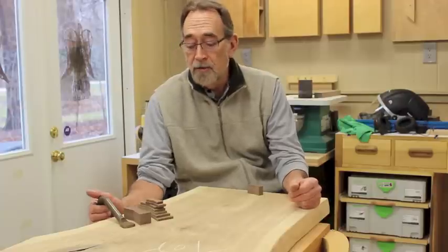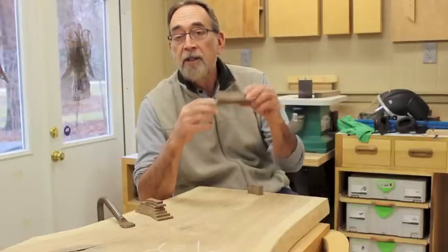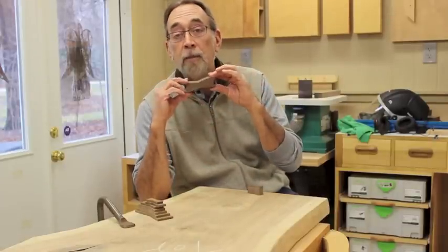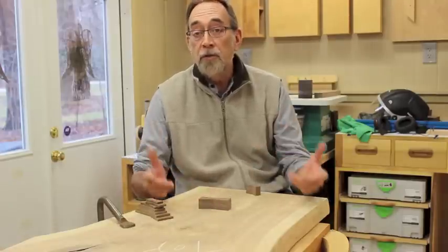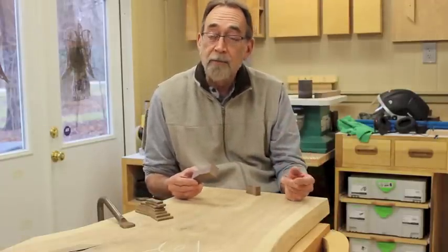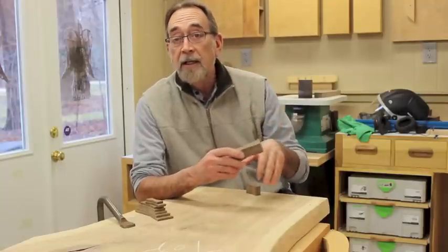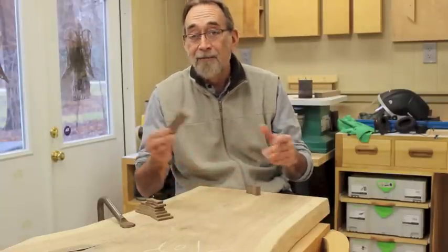In this particular video, I'm going to show you how I use a key. Some people call these butterfly keys, some people call them dovetail keys. I actually think of them as bow tie keys because they look like little bow ties. Whatever you call them, they're a great way to stabilize a crack in a slab. A crack in a slab is an insidious thing because it could continue to crack as time goes by, so you want to stabilize it. And if you use a contrasting piece of wood, it can actually be a decorative touch. So let's go through how to design and cut out a dovetail key, how to cut the mortise in the slab to fit the key, and then install the key and trim it flush.